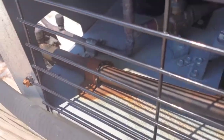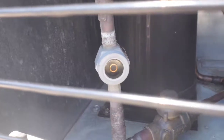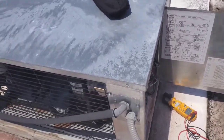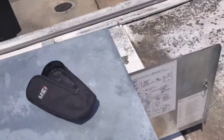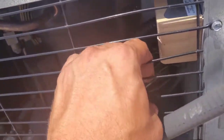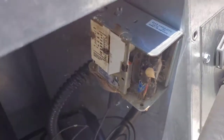It didn't get cold when I did that. All right, so we've got no power to the contactor coil. Let me just check something real quick. That didn't do it. I'm out of options, man — new unit. But for real, pressure switch is not open.